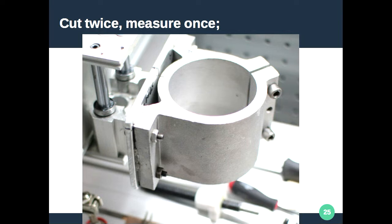I basically got a relatively flat piece of aluminium, cut the old spindle holder off, flattened it down, and there was a one-day transition from the old spindle to the new spindle, then the cabling and everything else. This upgrade works reasonably well — I didn't have any major issues with it. The alignment I tried to do as well as I could, but not at a proper machinist level, and it still works fine.